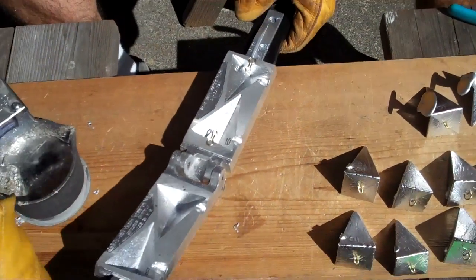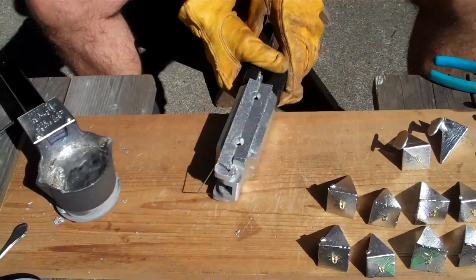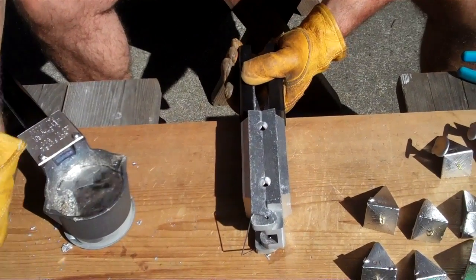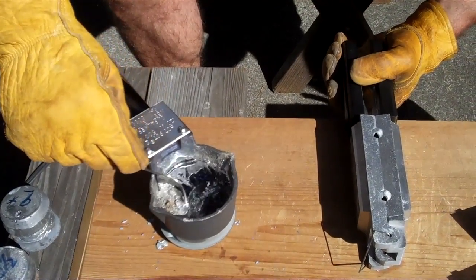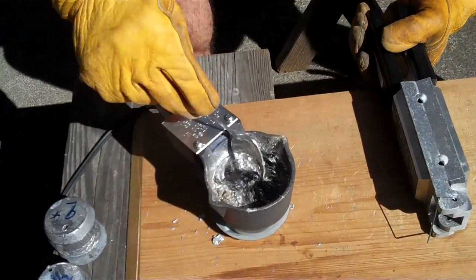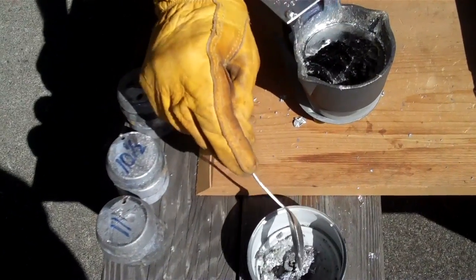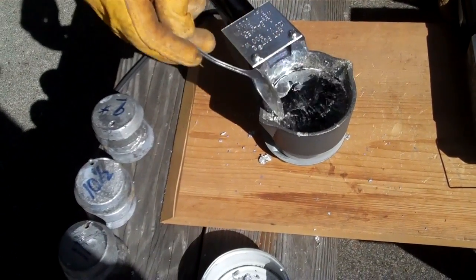Now we close the mold, just like this. Turn the mold up, and there are our holes that we're going to pour the molten lead into. You can see I'm stirring it a little bit, separating the impurities in the lead from the pure lead. They call it dross or slag, just junk — impurities in the lead. No lead is pure, but it's good to draw it off, take it off and put it into a tin can. Then you've got nice pure lead, easy to pour.